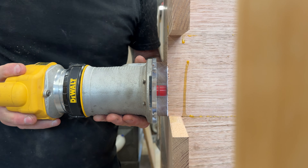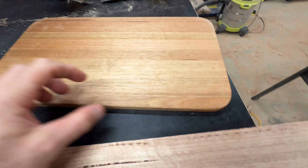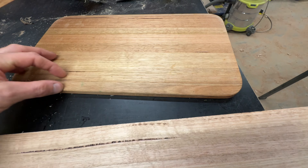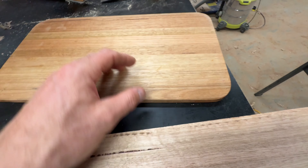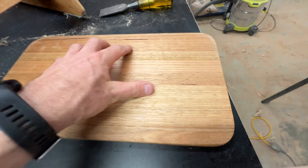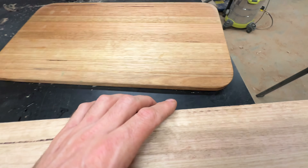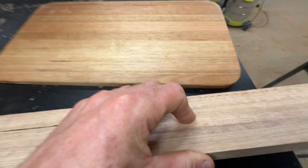The plan from here is to take another piece of Tasmanian ash and glue that across this board, leaving the two ends to still be able to fit inside these grooves. It will still be weak on the sides, but you'll have this big chunk of more solid material so that if someone heavy does sit on the edge, it won't be as likely to snap because it's going to be a chunkier piece.